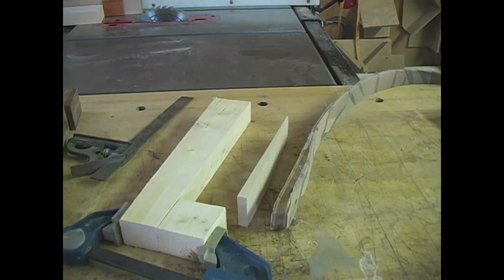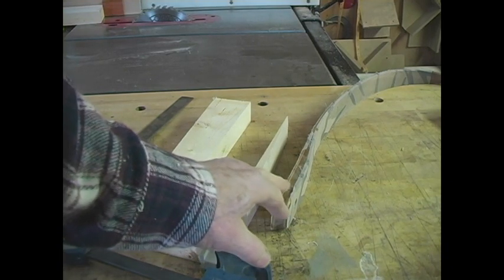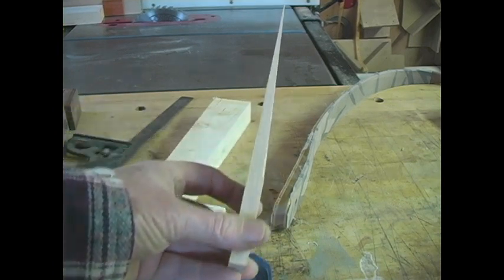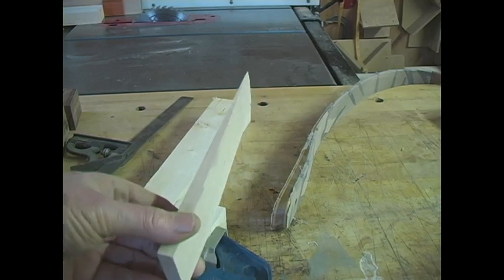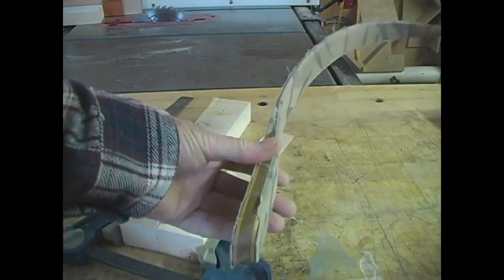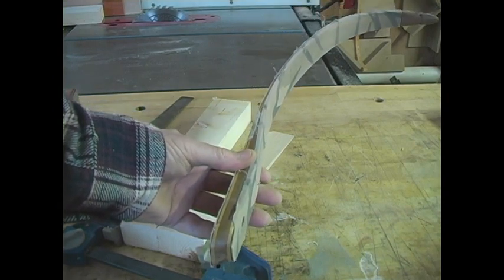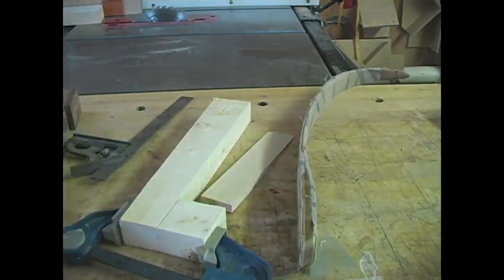If you look here, we have the jig and a limb. This particular piece was cut on this jig and you can see it has the taper cut on it — it'll be sanded as well to have a better glue surface — and that is what goes into the thicker part of a takedown limb. You can make these, build like ten of them at a time, and every one will be identical. It really speeds up your process.